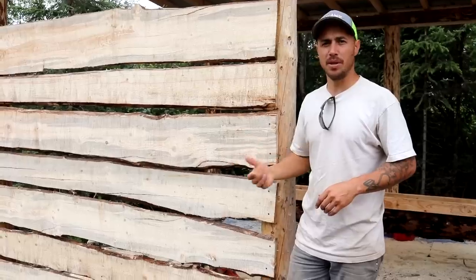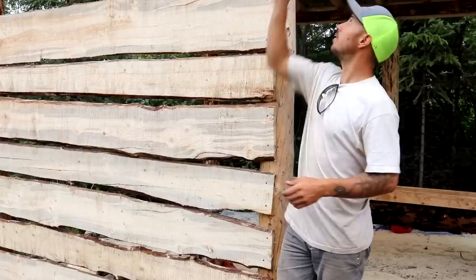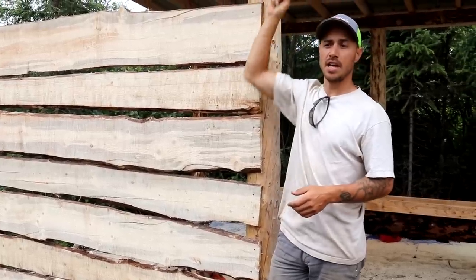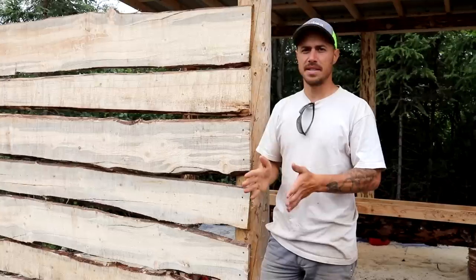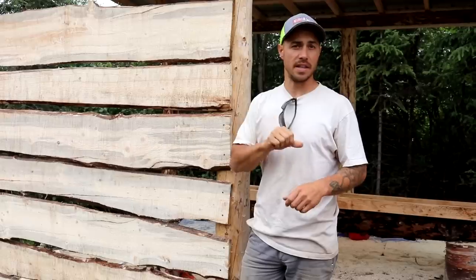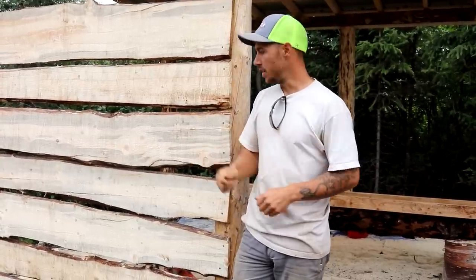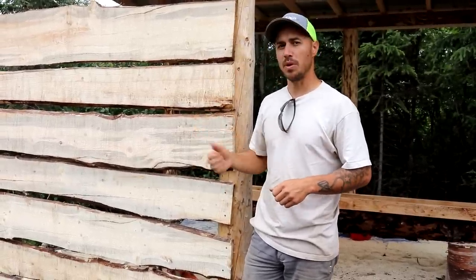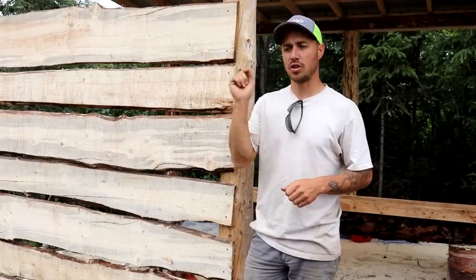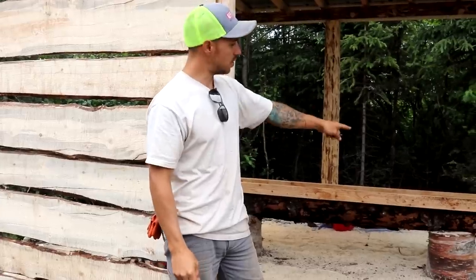All of the wood that I've milled this morning was from leftover pieces of these beams that we cut the other day. So I didn't actually have to use my guide system that I built out of my 2x4s. It was basically just put the chainsaw mill at about 1.5 inches and just cut. So we got these all knocked out pretty fast, but we are all out of those logs, and we have a trailer full of logs that Arielle is sitting on.